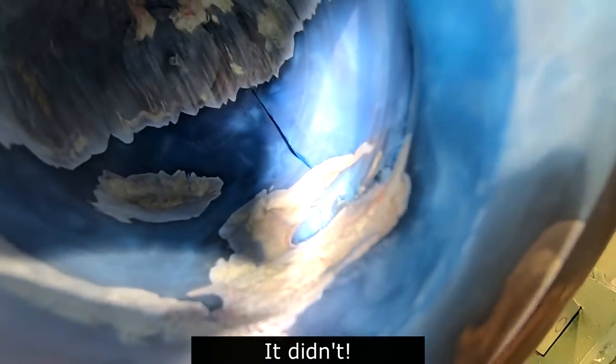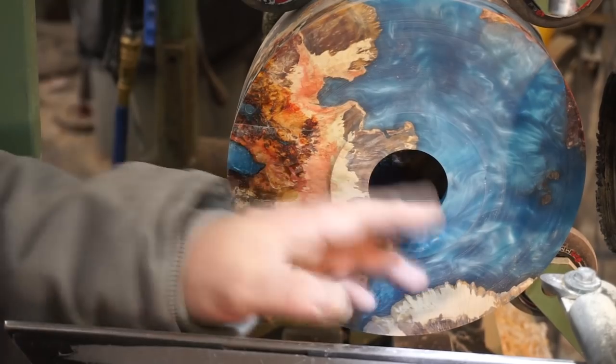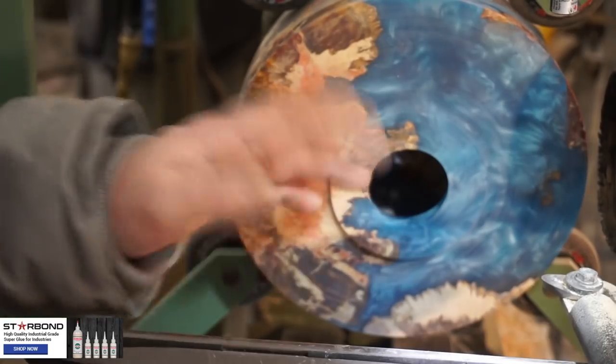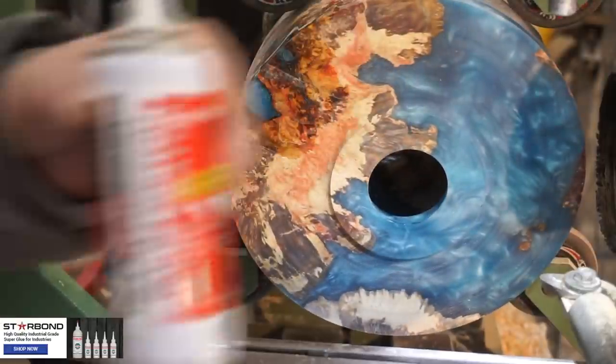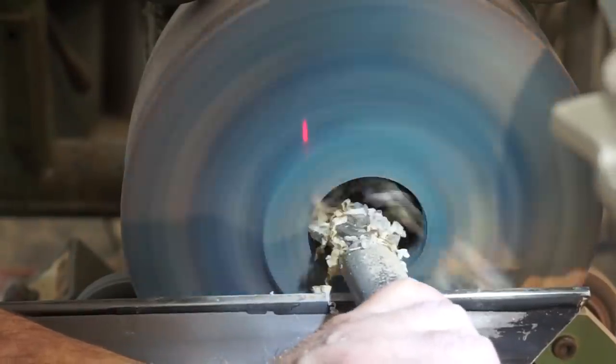I'm going to try and give you a little look in here. We do have some thermal cracks happening which are not cool - I don't think it's going to matter but that's what it looks like in there. The bottom's pretty decent now, we just move up the side walls and get this done. Before we carry on, I put some thin CA from Star Bond down in the crack. I don't think it's going to be an issue, but just to make sure it doesn't migrate any further I did that, and set it with accelerator so we can move on.